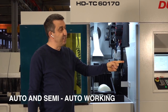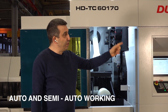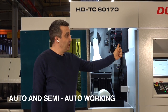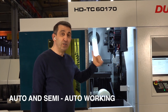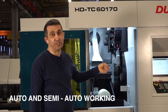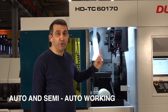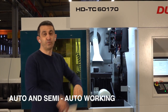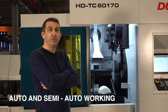Exactly, there is a chain system. After the meeting, I would like to share with you our video. On this system, you are manually putting all the profiles, I am repeating again, up to 10 different shapes on the chain. And you must write the order of the profiles correctly into the software. This is important because the control is on you now. So you must define all the profiles correctly, in the correct order and correct sizes, in the software. It's working like that.